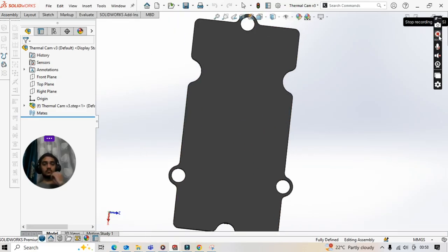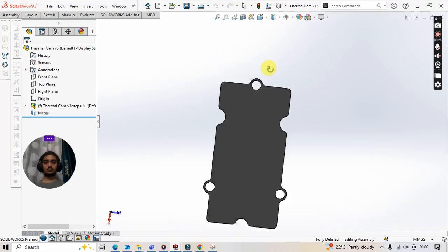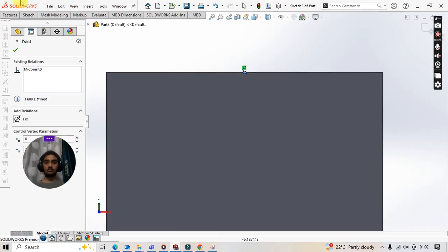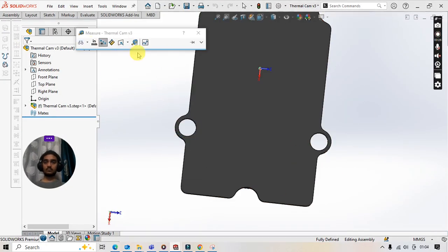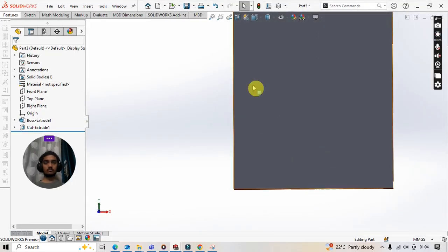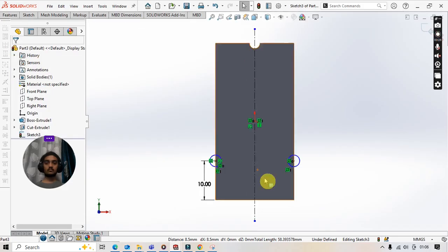If the sensor design had been a square one, we could have made the design a plug-in type connection, but since there are 3 mounting holes, we must change our design strategy to apply a nuts and bolts type of connection. This ensures the sensor stays firmly attached to the enclosure, a reliable and repeatable setup for testing and deployment.